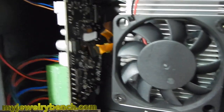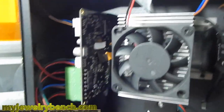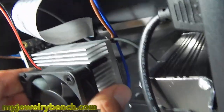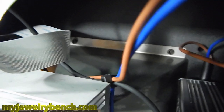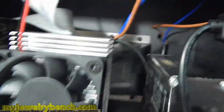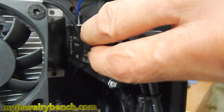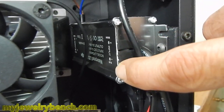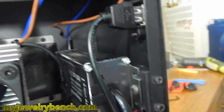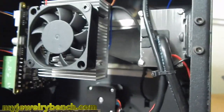There is a slightly different firmware version on this than on the Elegoo Mars. However, looking at the heat sink for the lamp, it is significantly wider with better cooling fins and it is a little bit deeper. We have a similar mounted shroud for the UV lamp. Now, I'm not saying it's not the same lamp, but we do have a much more powerful driver. The power supply for the UV lamp is right here, and that power supply is significantly higher in power than the one on the Elegoo Mars, which relies solely on the external power supply. While they may seem similar, they are completely different in design and functionality.